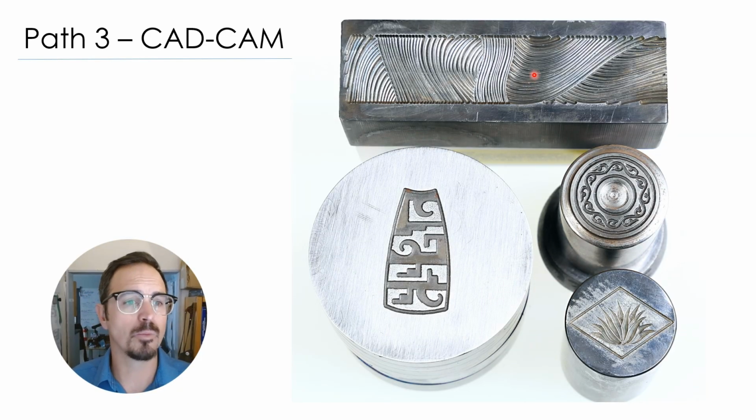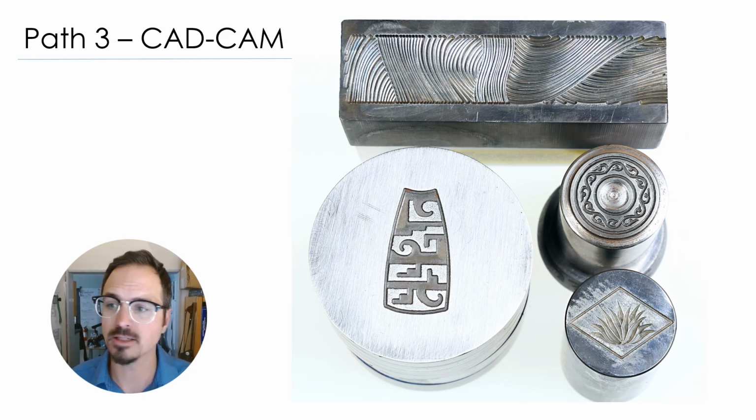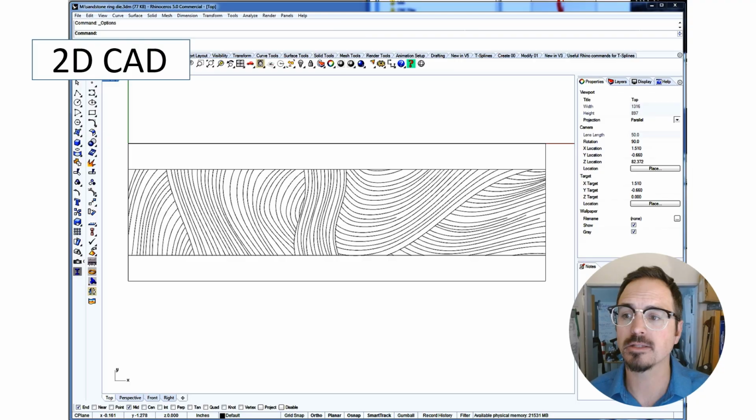All right, so path 3, CAD CAM, and this is an example of a bunch of dies that I've made, that Phil Poirier's made, just using 2D geometry. 3D surface modeling is a little more complex, and I tend to use a lot of 2D geometry to create these three-dimensional dies. And these were all CNC machined directly into softened tool steel and used as coining dies.